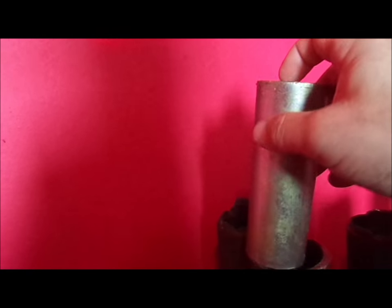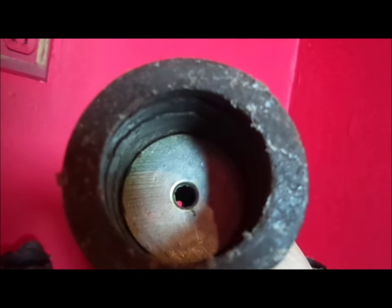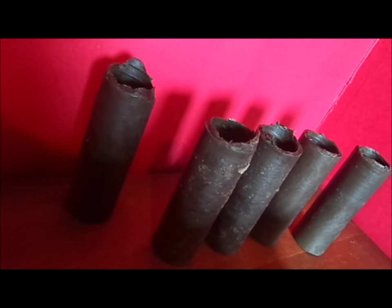Well, our next stage is to trim the record. So this is a trimmed blank. This is when it's checked on the mandrel. Some of the procedure for checking this is thus. This is a rough casting. The mandrel would go in there, and wherever the mandrel stops, make sure that it does not wobble at all. Wherever that is, that is where the casting is cut. Then you can see how it changes. So this is the trimmed casting that has been edged. It's been cut off and edged. This is a typical phonograph mandrel.